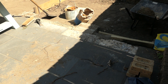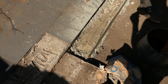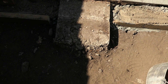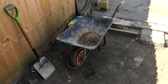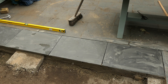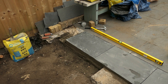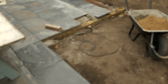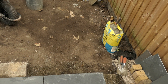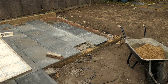Now to set the tiles in place on this side where I've taken the half slates out. I've put a concrete base down here which is now set, so I can set the full tiles in place to replace the half tiles. I'll set one tile halfway over this concrete pier. I've just done these four tiles — set them in place and done the edging. All I need to do now is cut the end tile into place. I need to build a little brick wall of three half bricks at the end to extend it in line with the other tiles. I won't grout the tiles yet until I've done the decking, and I need a couple of days of dry weather before I start grouting.